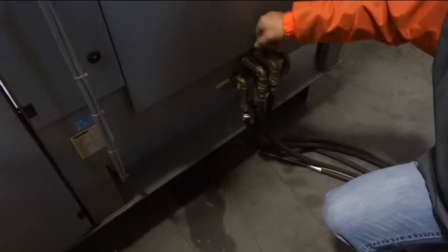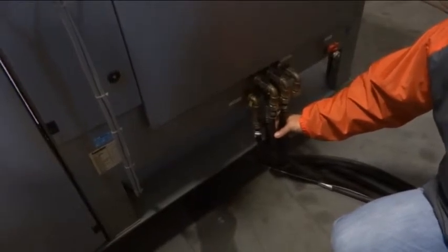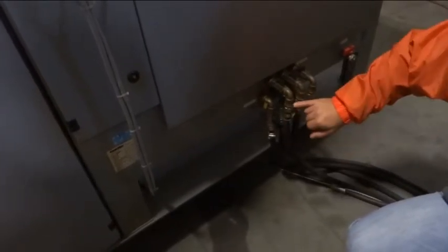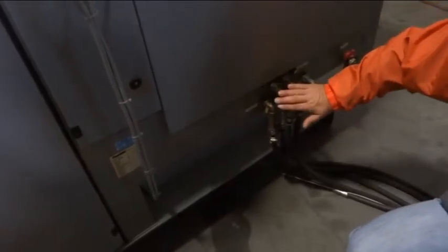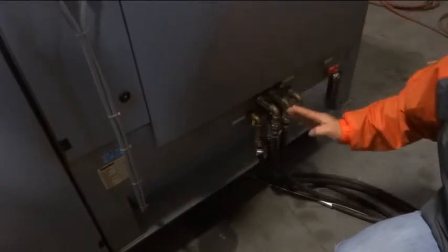So when we go back to the chiller, these little things will be closed. We have 4 hoses on there that go to the chiller unit and chill the table, and the other ones go to chill your spindle, okay? So they're all labeled too. We put them all in there and they're all marked too. And we close them so no glycol will run out during shipping. Here, they can be closed here. And they are all connected.